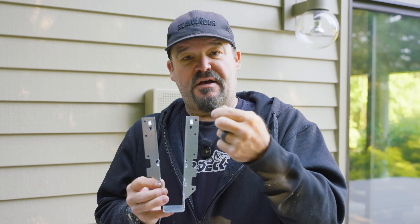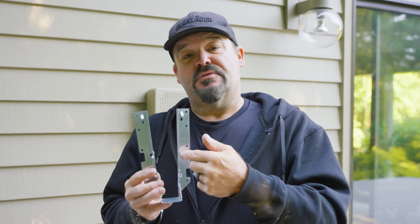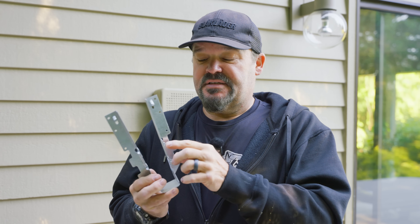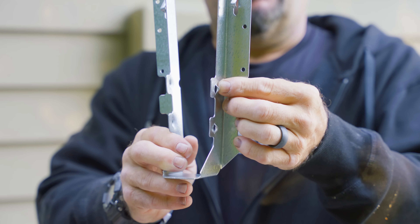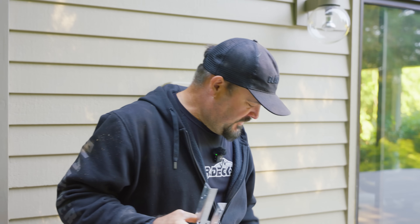We're going to run inch-and-a-half structural screws — they call them SD screws — into the face holes. And then we're going to run a two-and-a-half inch SD screw through these four double-shear holes so that it ties the joist to the wall and to the hanger. It sits nice and flat up against the joist hanger and pulls everything to the wall. It's called double shear strength — double shear screwing. They used to be stamped 'double shear nailing,' but they actually sell right here different length fasteners for your joist hangers.